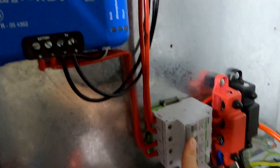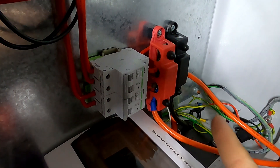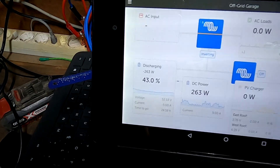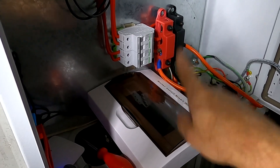I've already turned off the DC out from the solar charge controllers. The next thing would be to disconnect the battery, but the inverter is still running from it and we are at 43 percent state of charge, so the battery won't get any charge tomorrow. Today is Thursday evening and I've just started after coming home from work. It's going to be very tight — tomorrow we have to disconnect the bus bars, the battery, take the battery cables all out.